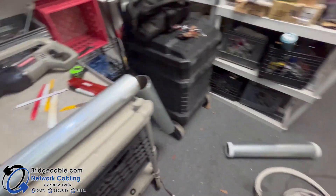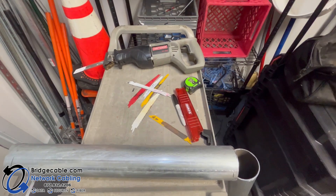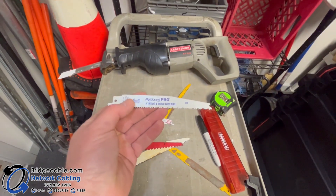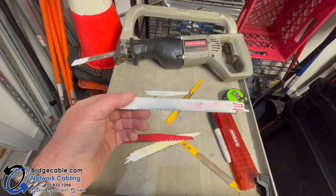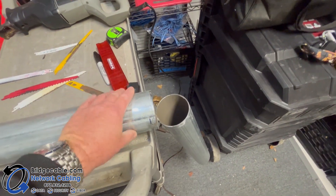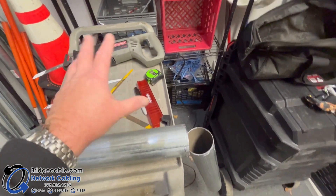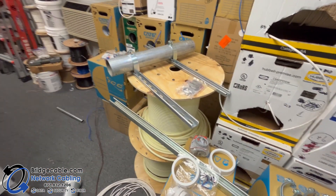There are many ways to cut this. This is my old-school corded sawzall and I love it. You want to use metal blades. For people not familiar, the blade will usually tell you what it's used for — this one is wood with nails, so the teeth are different. This one here is a metal blade — you're going to want a brand-new blade. There are also band saws, and the old-school hacksaw, but that takes a lot of elbow grease. So this is an overview: sawzall, cutting pipe, laying it out — and we'll show a completed one in a follow-up video.